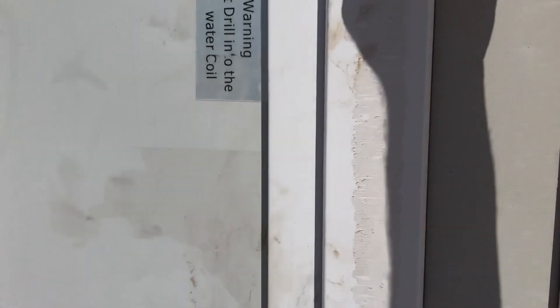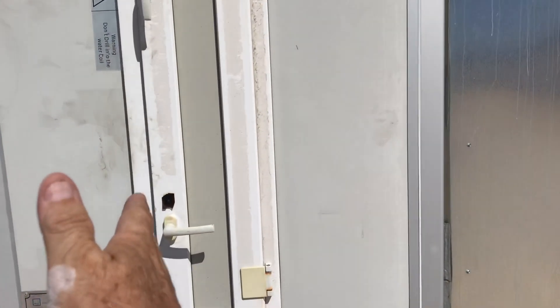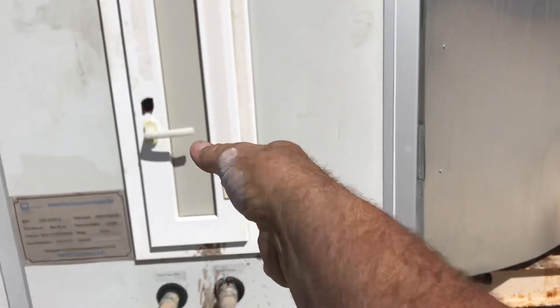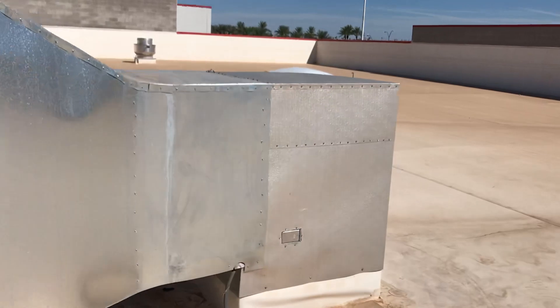You can see that coil right there — that's where the water is coming from, being passed through on the indirect side. So on the direct side, that air is coming through, going across this coil, there's another basin of water, it's cooling down that cell deck, absorbing more heat, and it's coming down here through the supply duct.